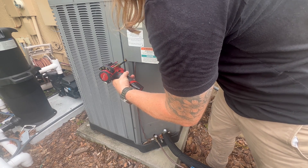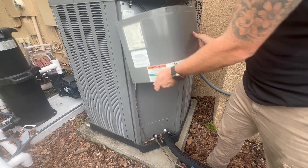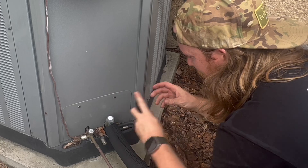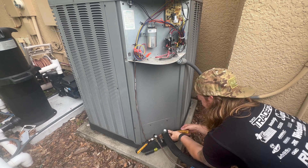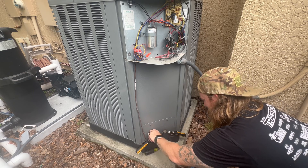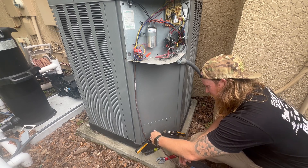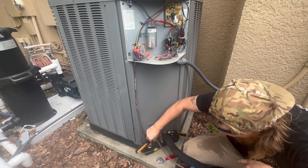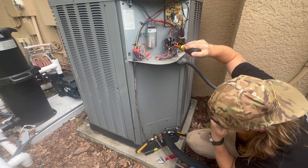We're going to pump the refrigerant back into the compressor and shut our valves off. That way we can just cut that freely and save whatever they may have in the system — try to save them what we can. We're going to replace this as well. Unfortunately there's really no room inside to do it, so we're going to have to replace it back outside here.